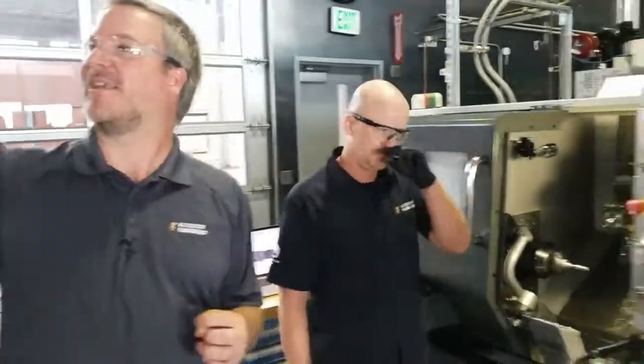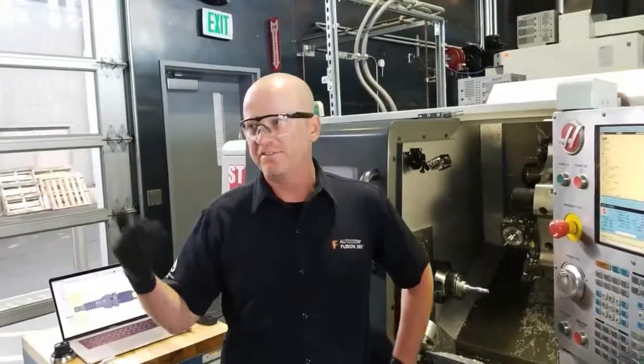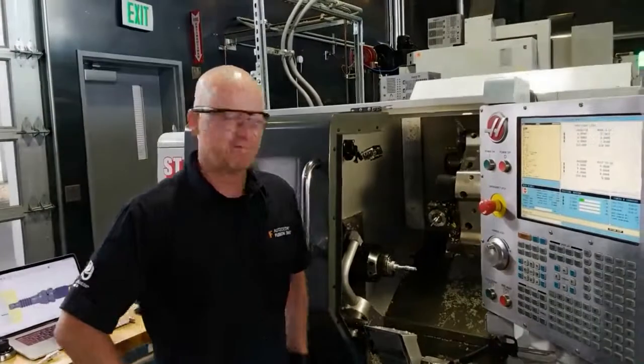Yeah, and there's a bunch of different machines out there. There's even the desktop 5-axis Pocket NC. You can make pretty small parts with it, probably about this size, all the way up to the Matsuura over there. We've got a DMS over here. What's neat about all of these machines is we test Fusion on all of them. So when we write posts, we make sure it works on the water jet, the Haas, the Tormach, etc. You can start with machines in the $5,000 to $6,000 range, and then there are machines like Tormach, I don't know exact pricing, 10 to 20 thousand, I think. From there you can get the Haas Tool Room series machines, in the mid-20s to low 30s, and they work up from there. There are other machine brands too. It all depends on your budget and your workspace, whether you need single-phase or three-phase power, and whether you're doing it at home or have a shop. Those are things to consider.